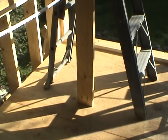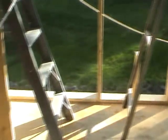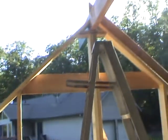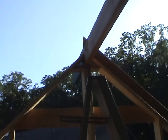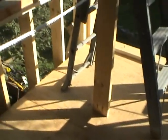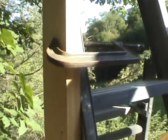That's what I use to find the place where the top of the roof goes. So here we are on the roof of the cabin, looking back from the way we were before, and you can see there's where the tip of the roof is — the ridge pole, as they call it. And over here is the way I figured out where the ridge should be, by taking a piece of 2x6 and clamping it onto this ladder.